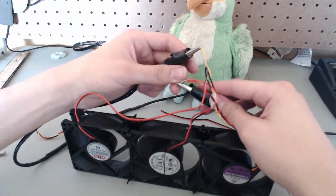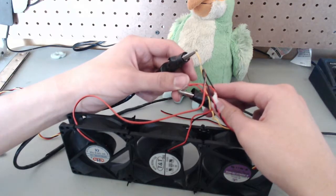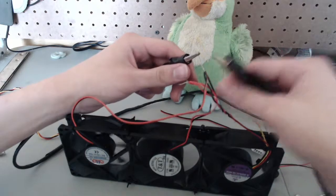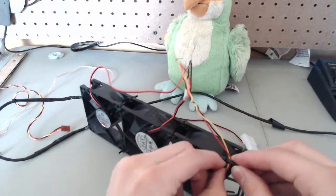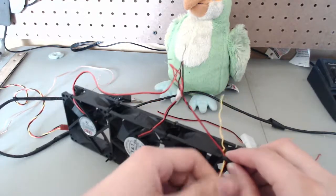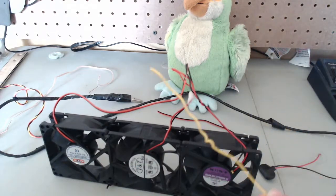This is going to be run off of either 9 or 12 volts usually. Though if you wanted to, you could probably put a USB plug on the end of it and power it that way as well, but this should be good. This is a PWM wire — we can just cut this off, it's not necessary at all. I'm going to cut it off where it starts because it's a piece of wire I might want to reuse, and it's best when it's as long as possible.